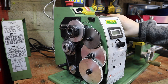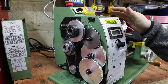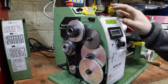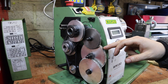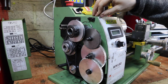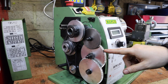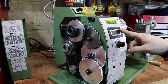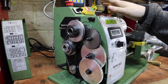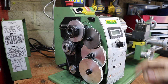Something I hadn't really considered in the design process — because other people online have done 100-tooth gears and I hadn't come across this issue — is that on the Warco WM180 I can no longer fit the protective cover over the gears. That means I'm going to have to find a way of holding the safety switch in so I can test these gears and see how good the final cut is. While I find a way to prop that up, sit back and enjoy — when we come back we'll be seeing a lovely finishing pass.